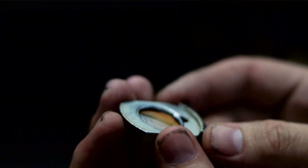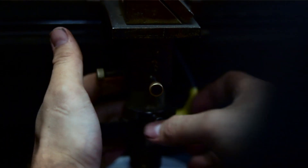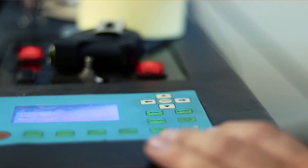I'm gonna pop that right back in and we'll jump onto the computer and get started with our cutting. Over here is our keypad for the laser, so we can basically control the laser. I'm just gonna orientate it to its origin position, which is basically where it'll start cutting. We've set the origin to the top left-hand corner — it's very important because when we bring in our artwork into the software, the orientation reads from the top left of the working area.